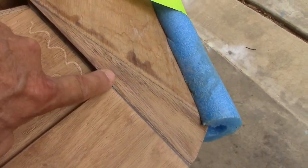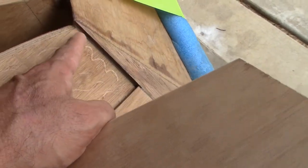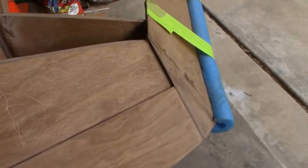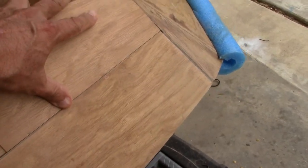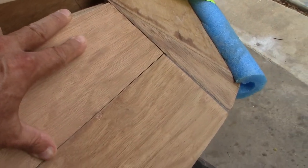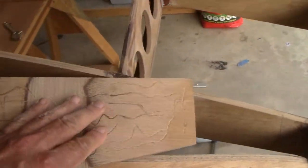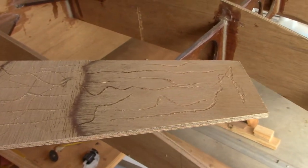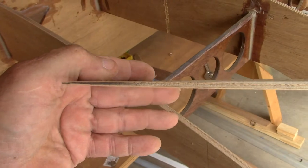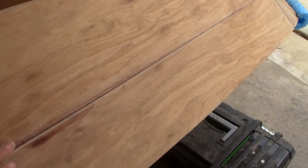I just need to address this edge right here, because when I built this I originally designed it for this line to come all the way up to this corner. What I'm going to do instead is leave this just the way it is, with the exception of this little filler piece I made — took me a few hours yesterday. It's going to bond in place and taper and fair into that bottom panel. I set up an improvised router sled and brought it to a real narrow taper right there.